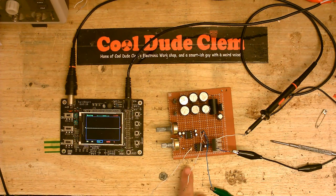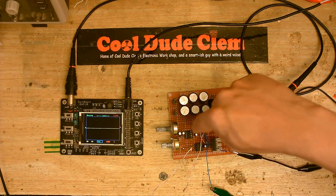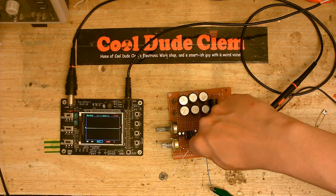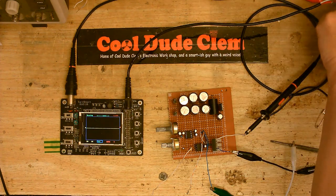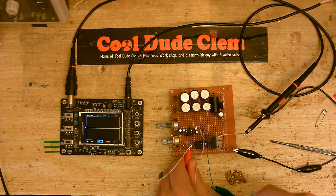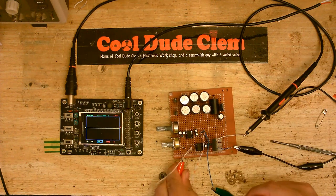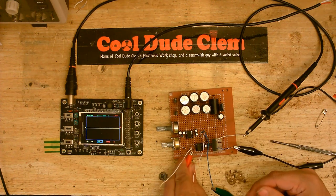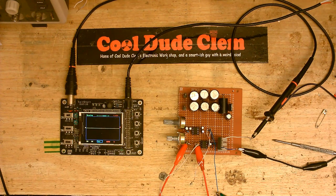What I'm going to do is bridge pins two and three together, which will just involve connecting this wire to this wire. Whatever's coming out of the Triple Five Timer should go straight through the gate driver chip and into the MOSFET, which is where I'm actually measuring my signal. I should have mentioned that before, but I never prepare before I actually start recording. Through the magic of video editing, that is now connected.